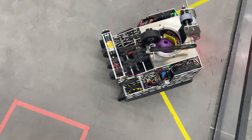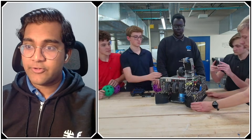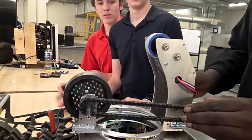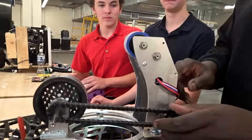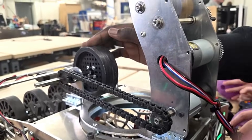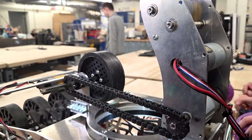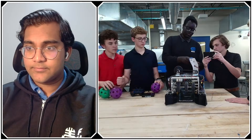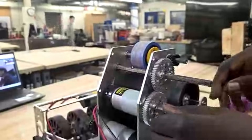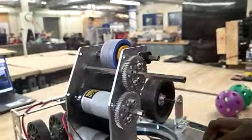Let's jump into the shooter. I see you guys have two wheels — a front roller and a rear counter roller. Let's start with speeds. How fast are each of these spinning? The main shooter wheel is on a 1:1 ratio on a 6,000 RPM motor, using a 96 millimeter rhino wheel. For the counter roller, we have that at a 3:1 ratio, so it outputs around 18,000 RPM with 6,000 as the input. We use two gears to power that, then a 1:2 gear to power the last set.